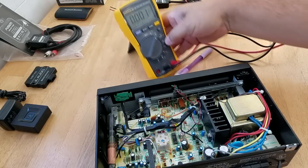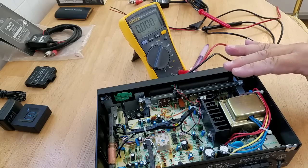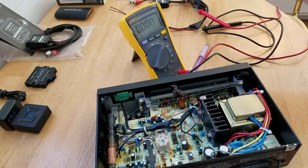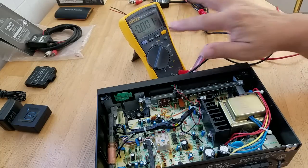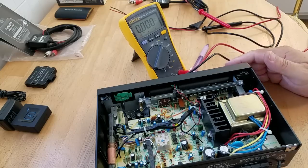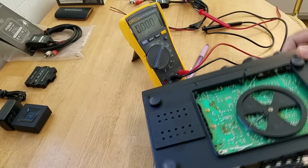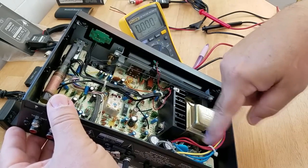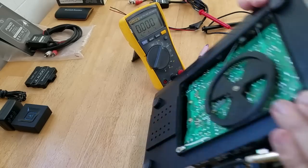Here's what you're going to need: first of all, safety first — don't touch anything with your bare hands. If this is over your head or seems dangerous, just stop the video and don't go any further. You're going to need a good voltmeter. I'm using a Fluke 115 — an excellent meter, relatively inexpensive at around $140 to $150, well worth the investment. I've figured out this is my high voltage area, so I won't touch it. My target area is this power supply section with these filter caps. I'm looking at the capacitors — the negative side is the chassis ground — and I'm feeling confident I'll get a clean 12 to 15 volts off here.